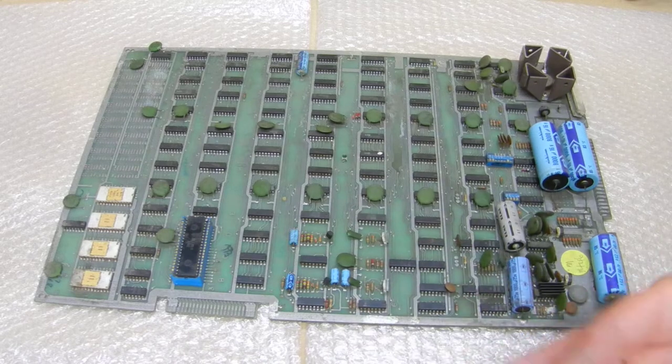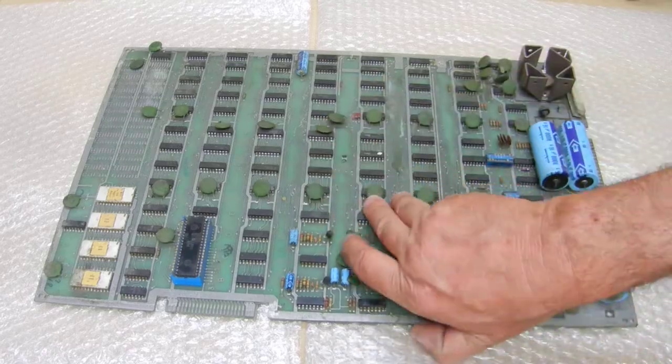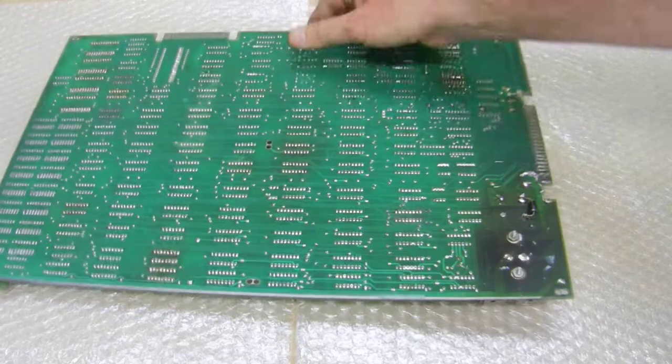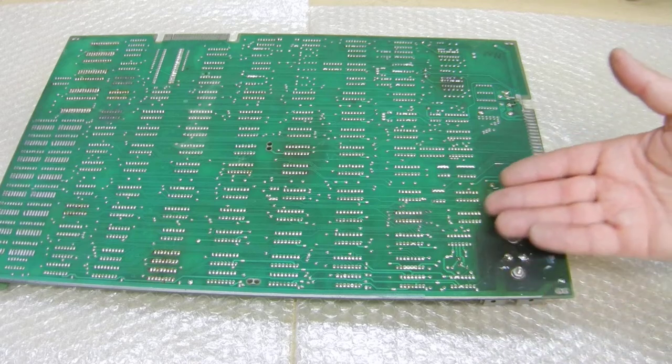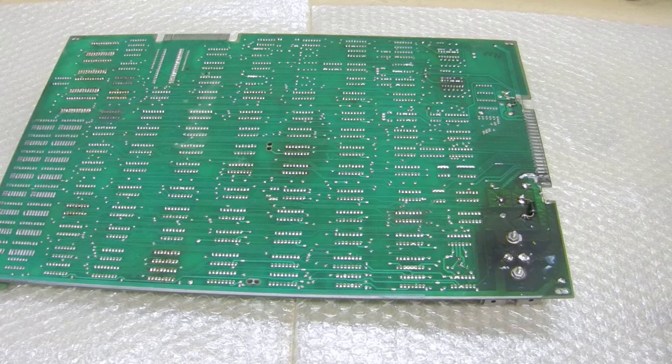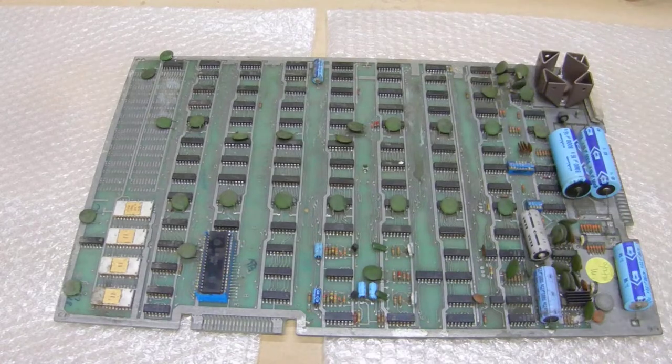This was Atari's test fixture - you put a test fixture in their looms and you can test their board with their fixtures. Atari had their workshop, so whoever was an agent out there would get this Atari test fixture, similar to a Bally, Williams, or Gottlieb test fixture for testing pinball boards. This is the bronze era - it hasn't been touched, just sitting around for years. These were on seven days a week, so the board was drawing so much current. The solder starts deteriorating, you get more current drain, it heats up - that's what happens.